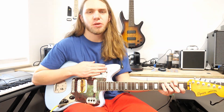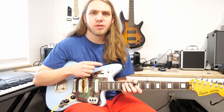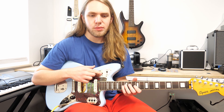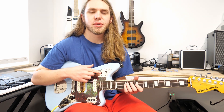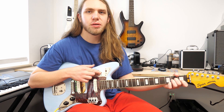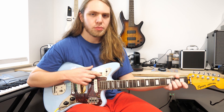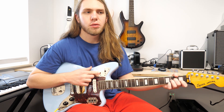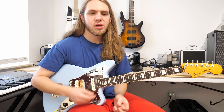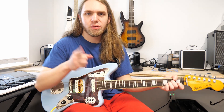So here it is, it's all finished. The tone on the neck is working as it should, although the taper on this capacitor — maybe the pot too — is not something I would have chosen. You get most of the effect near the end of the taper. All the way on, it's quite dark and thuddy, then it clears up a little bit until most of the taper is actually nothing. It's like almost all or nothing, basically. At a later date I will be experimenting with different caps and pot values and tapers and all that stuff, so stay tuned for that if you're interested.